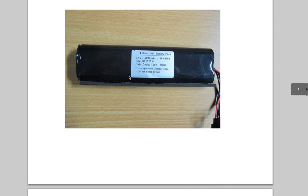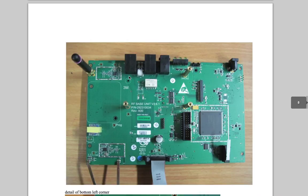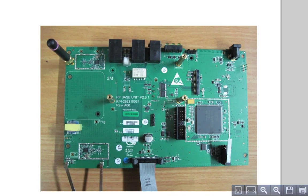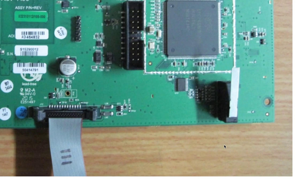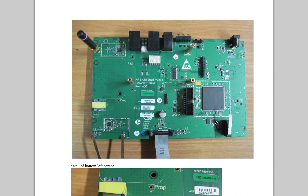Then we get a lithium-ion battery pack, which is thoroughly uninteresting. And then here's the main board of this thing. The first thing that jumps out at me is — wow — big old thing, and then immediately a big old switch. I'm willing to bet this is a tamper switch, so if you open up the unit, that goes click and it immediately sends out an alarm somewhere. But it's adjacent to this big old microcontroller here.